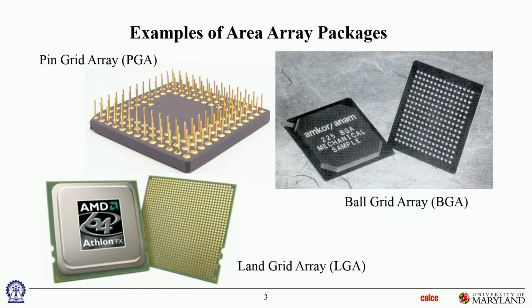This level doesn't have an underfill because it's between laminate and laminate. Right, that's a very good point, and I missed mentioning that. Because it's an organic substrate for the component, and then it's soldered onto another organic PWB, there's not much CTE mismatch there. Of course, in the center region there will be a little, because the die will reinforce the center region of the component substrate, and that will constrict the CTE. But it's not a big enough problem that they had to put underfill for the second level. The underfill is only in the first level.